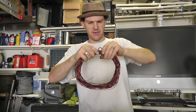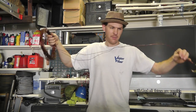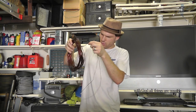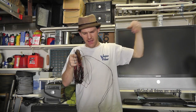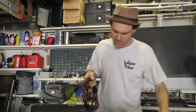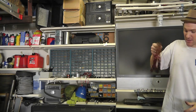It straightens the wire. What I normally do is take a coil, go down in my basement, and just walk around — I'll tie one end onto something and then just start walking, slowly untangling it one little bit at a time. You can also do it out in your yard, but I just walk the whole coil around the garage, the lab, the basement — wherever nobody's gonna bother it. Then come back with a spool on a drill, a spool on a piece of all-thread, and go real slow, walking back the way you went with the coil, and just spool it up. That's what I do to make this happen.